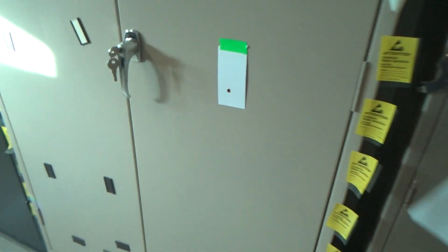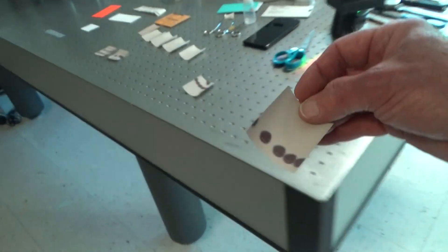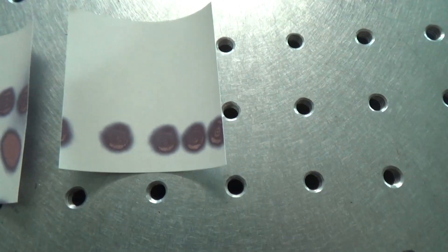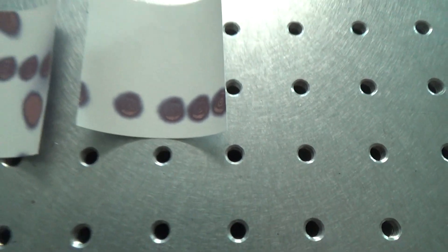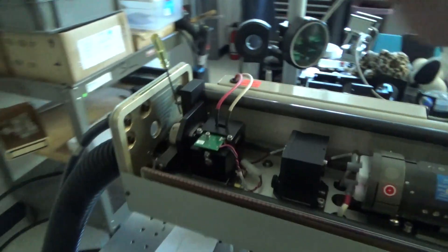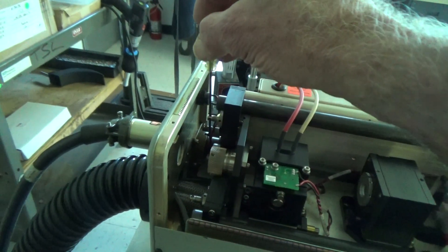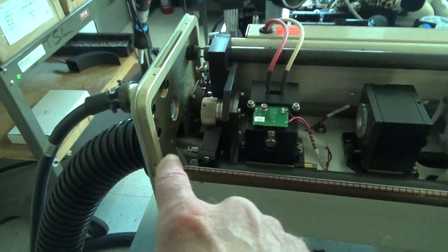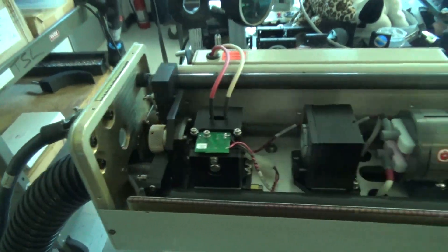Going back to look at the output, you can see now we've got a beam that's much hotter on the bottom side — so I've misadjusted it. I can definitely get that back again by moving the YAG back into the correct position. Side-to-side adjustments are done in the same way using the lower adjustment knob.